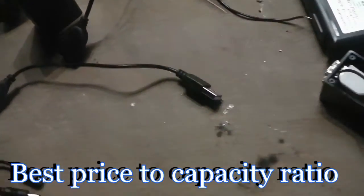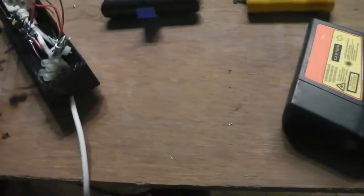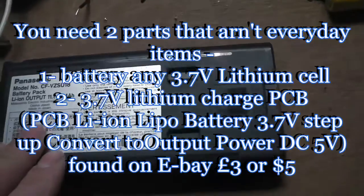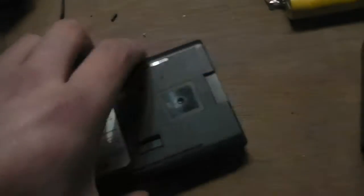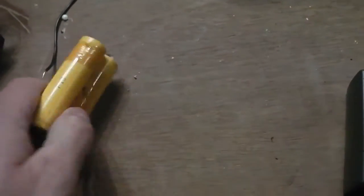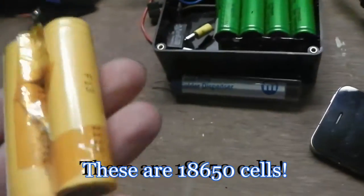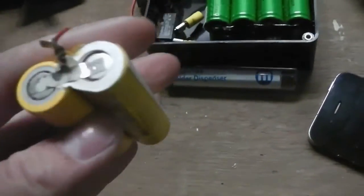What I'm doing at the moment is making my own one with bits that anyone has laying around, except for possibly the battery. If you take an old laptop battery and dismantle it, you end up with 6 to 9 decent-sized cells. You can buy these off eBay or from a computer shop — these were second-hand batteries and they're still good. Once you strip them apart, you can solder them in parallel.